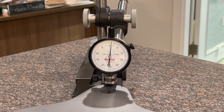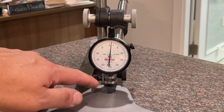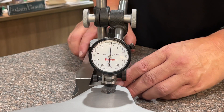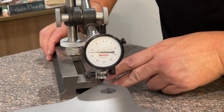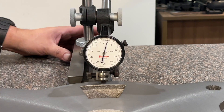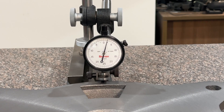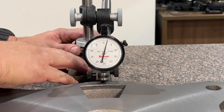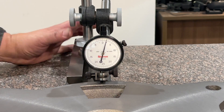That is not bad. Based on our opposite corners reading different off zero, we have a plus one here and then 180 degrees out we've got a minus one. So it looks like we've got about two to maybe two and a half thousandths out of parallel that we're measuring. I want to come back and measure the middle of it as well. Yeah, there is a high spot right there. So that is two thousandths right there — about two thousandths out right there.